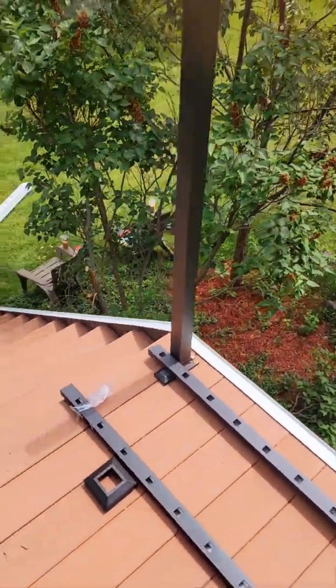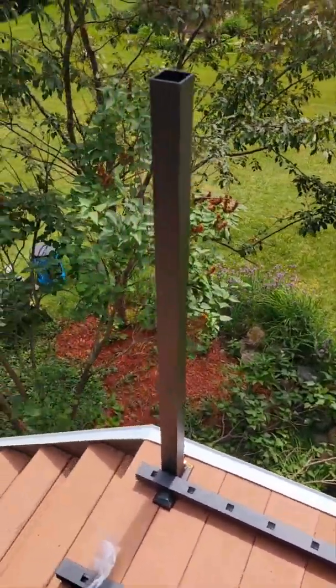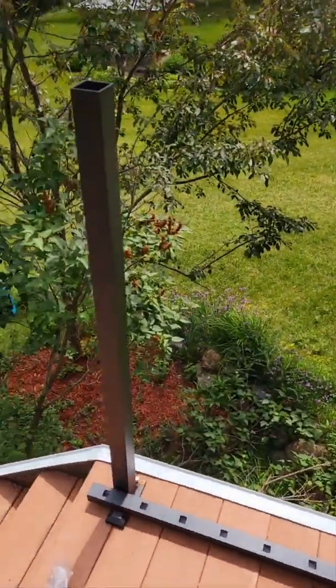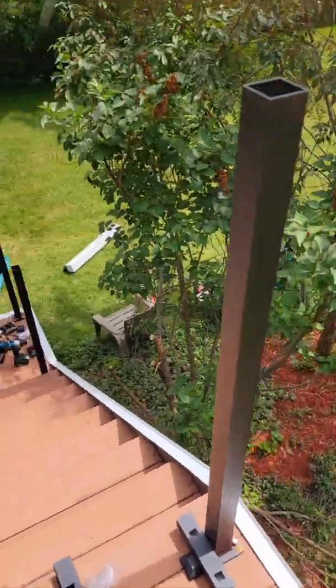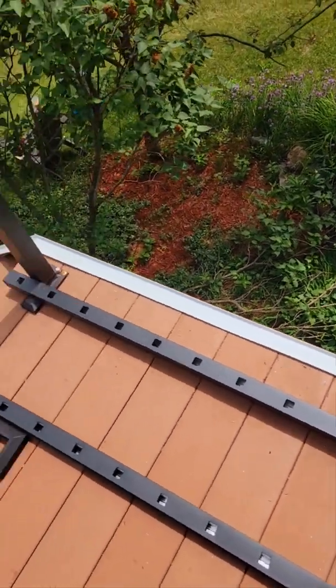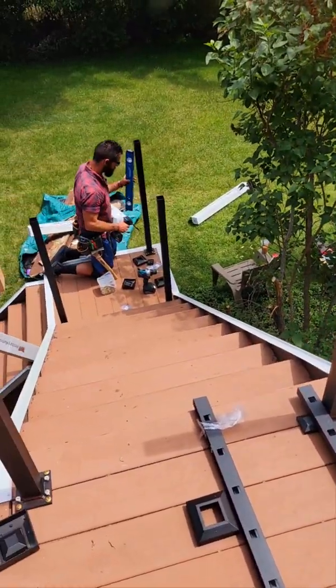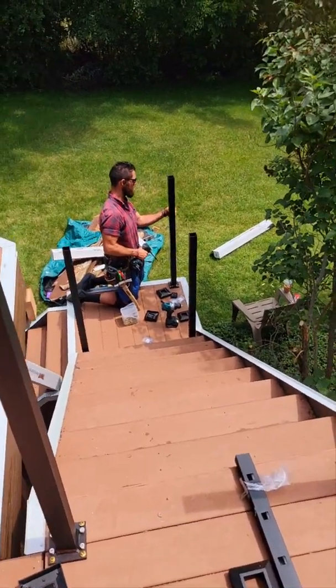Again, those cliff notes. Check your spaces, measurements change. Sometimes if you didn't plumb it perfectly, it can mess you up a little bit. Change the spacings left to right. And then obviously figure out equal distance left and right by simply putting it there and scribing. I found scribing sometimes is the best method and the most formidable opponent to doing something wrong.